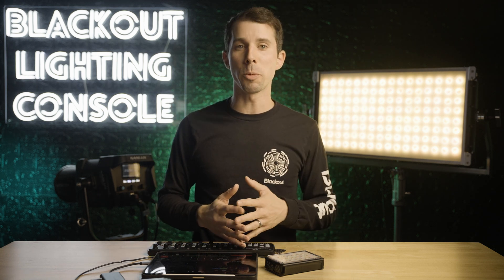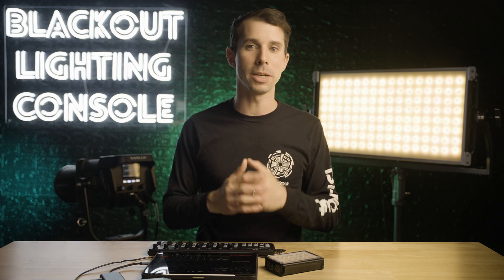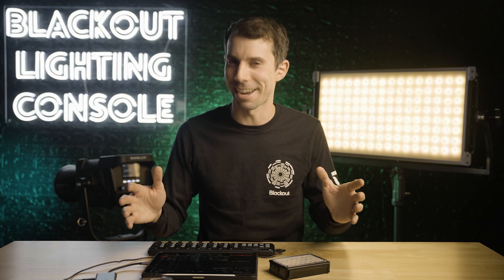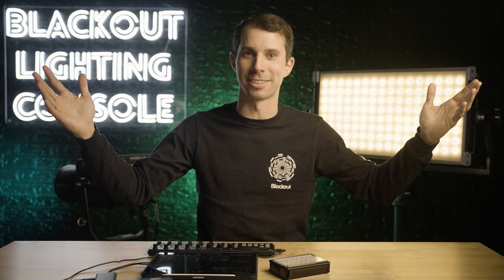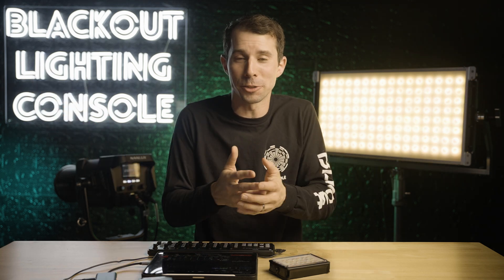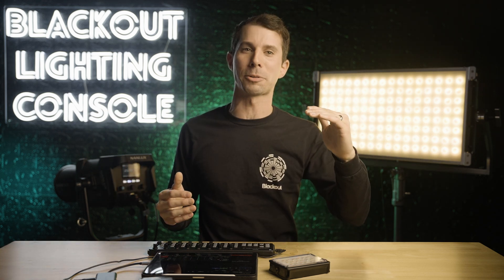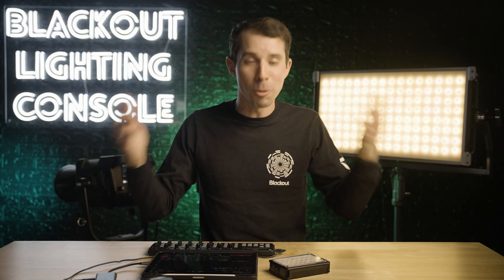If you watched my last video on strobing, the max DMX rate, although technically is 44Hz, is limited by your console or hardware. GrandMA's max DMX output is 30Hz, or 30 times a second, which I am still floored by. How is the entire MA community not up in arms about this? I love this console too because there's just so much you can do with it. But are you insane? You're slowing down the DMX output to 68% of its capacity, and DMX is already slow. And you're one of the most popular consoles!